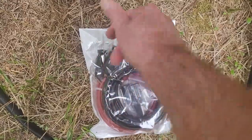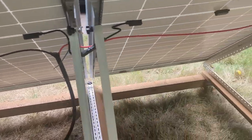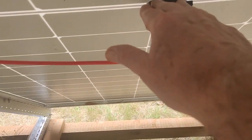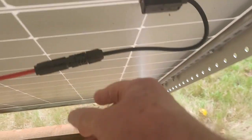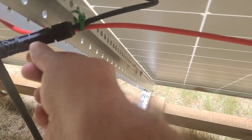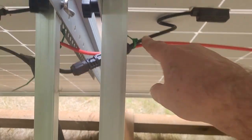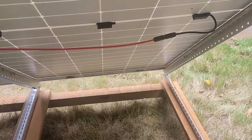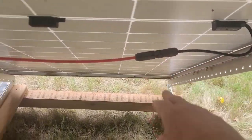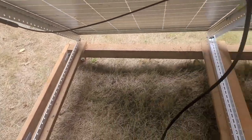One of these looks male but it's actually the female connection — the negative — and then the positive. These just snap together: you push them until they snap. Most solar panels come pre-wired like these, with an electrical junction box in the middle with some electronics, and then on each end there's a cable with an MC4 connector. To connect them in series, you put the two panels next to each other, take the positive from one and the negative from the other, and connect them in the middle.